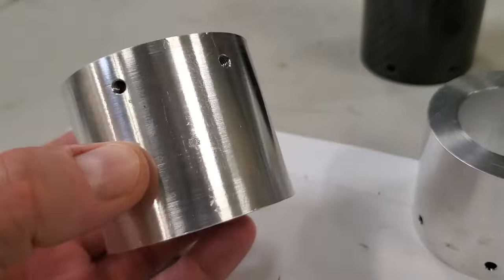With the parts printed, first thing I will do is sand each of the faces to make sure they're nice and flat, but also key the surface so I get a good bond with the adhesive. Checking to see that they fit together nice and tight. Using my favorite DP420 adhesive here, with a little bit of black dye so it looks nice and black.